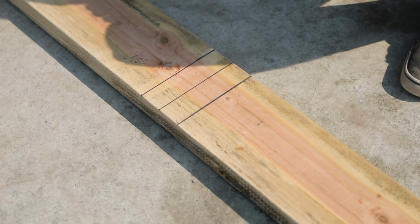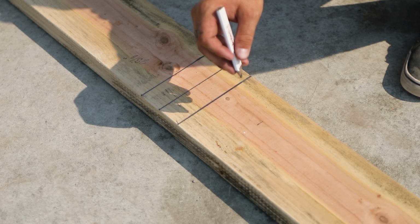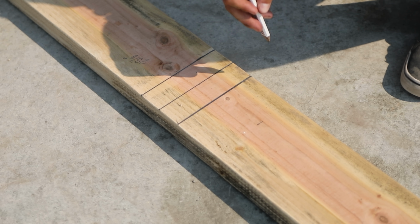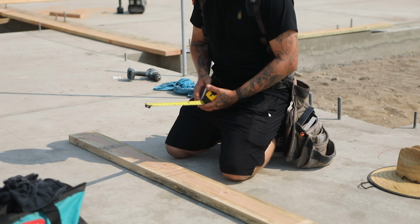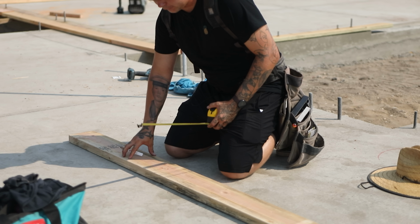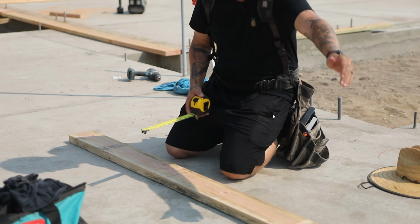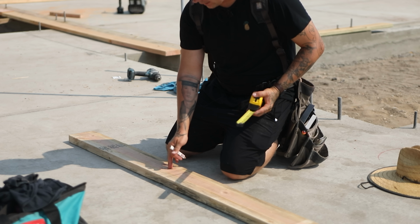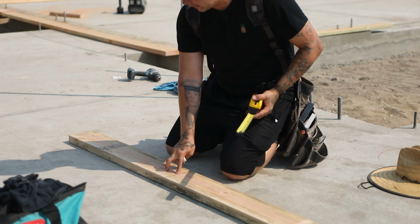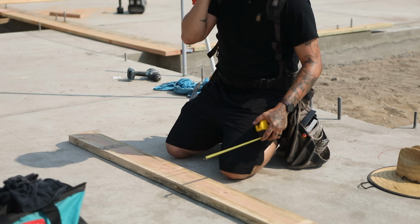So you go through and map out the whole wall assembly and put your headers and your window sills in, and that dictates what you have for bottom cripples, top cripples, and everything in between. So ultimately what we're doing is we're laying out bottom plate, we're laying out our studs all the way up to there, our double top plate up top. From there we put the header in here, we pull down, get our rough opening dialed in, put our sills in. That gives us our bottom cripples, our top cripples. We can also get our trimmers if we wanted to in here.